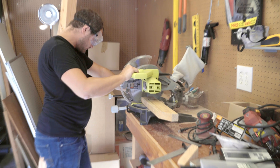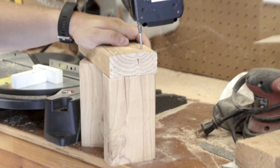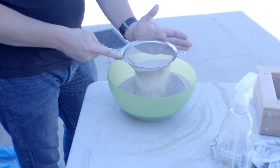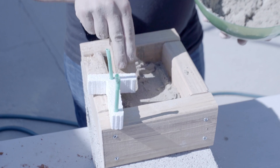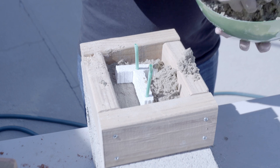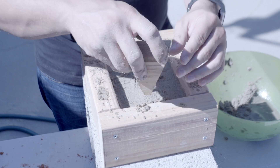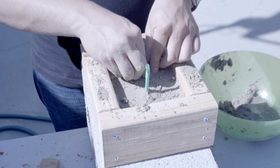For the non-plaster materials, we'll just cut and screw together some 2x4s for holding the sand. Next we'll do the play sand. Add play sand and some water into a bowl — the water is necessary to make it pack tightly around the foam. Transfer the wet sand to the 2x4 mold and place in the tee with straw vents. Add some more sand and make the basin.